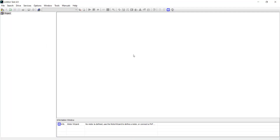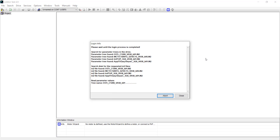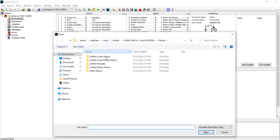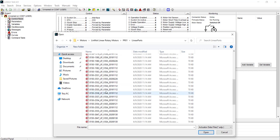The first thing I'm going to do is log into the drive. I am logging into the linear drive, as that is the part connected to the linear part of the motor. I'm going to go into Motor Wizard, select linear rotary parts, select the family your motor is from — in this case PRO1 — and after that specify that it is a linear part.